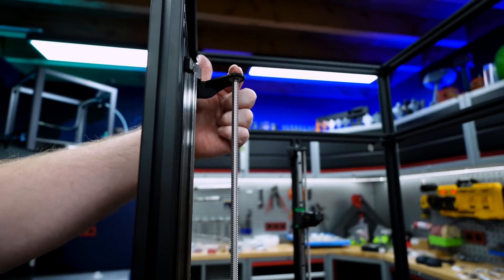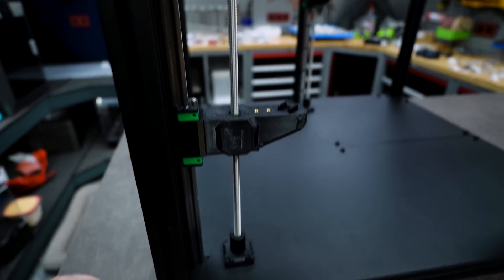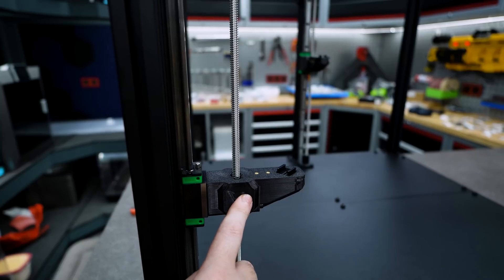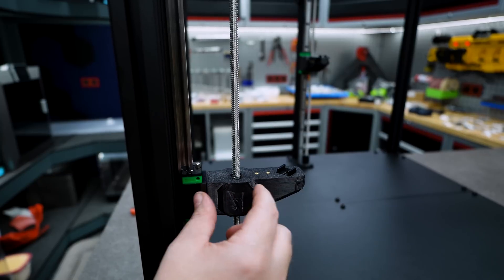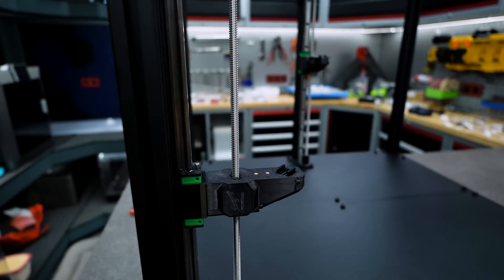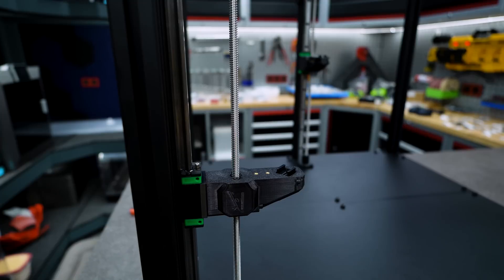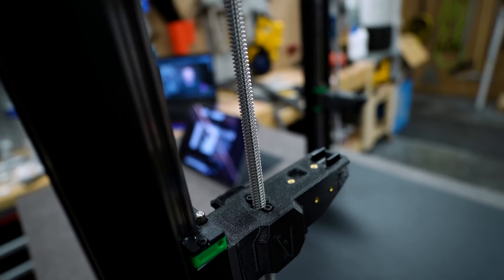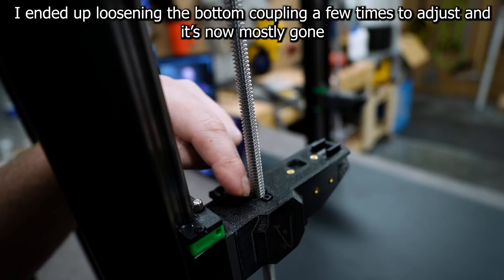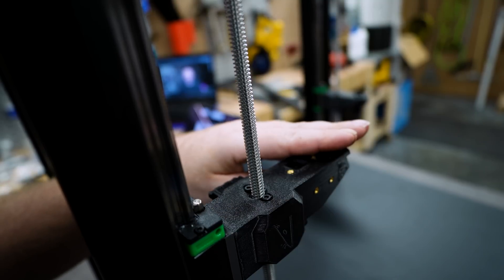And there we have it. We have mounted the top bracing for the Z-rod and now we have a complete motion system for the bed. One thing we can see is that they are using a coupling inside that has the room to move this way but also this way. I could see on this lead screw — and not only this one, also the one in the back — it has a little bit of a wobble, and this one is going to be the worst offender. The couplings are working very nicely; we can see the lead screw is rotating without affecting the stability of the print, so the bed should be nice and stable.